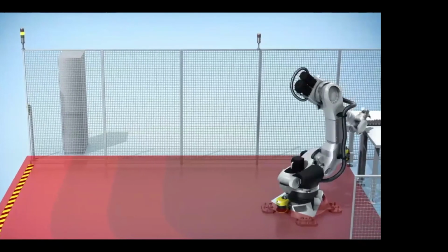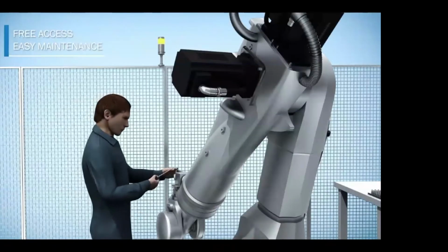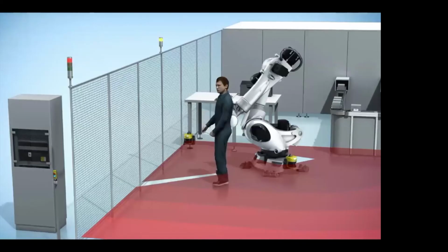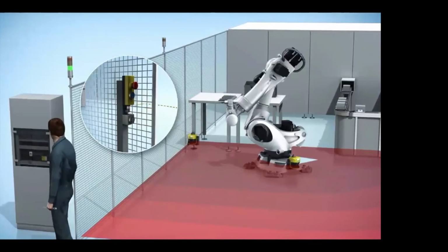When I'm a maintenance guy and I start walking up to the machine, instead of shutting everything out, I can walk right up to the robot. It'll completely shut, get into home position, stop. I go do my additions or my maintenance things I need to do on the robot. I walk out, it won't restart. You'll then have to reset the safety and restart the machine.